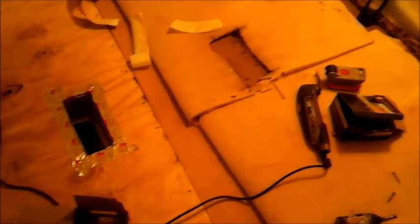Got the closet all framed in and refloored. Hallway's done. Bedroom's done. This is going to get carpeting pulled back and just carpet stripped on the outside edge, tacked on this side, transition strip there. Some shoe molding will go down here once the linoleum is laid. Oh, I'm red. Battery's dead.